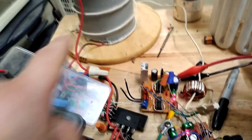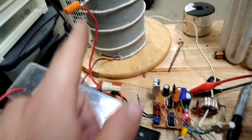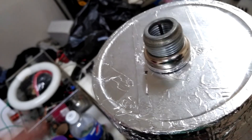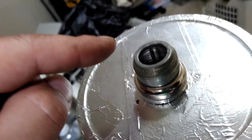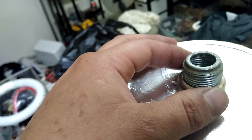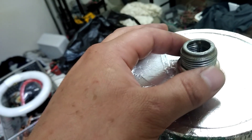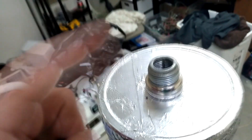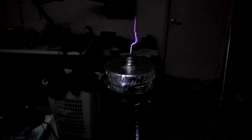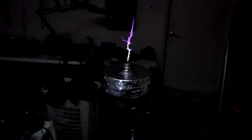I took a little shortcut here — I tried adjusting the primary without really changing it out to an optimal point, and rather than adding a bunch of top loading on here, I'm just trying to shape the arc so it goes more straight out. Playing with the low voltage setups I've been able to do that before — a lot of those already have sort of a vacuum tube-ish discharge. If I shape it like that I can get more of a straight-out arc and it's probably going to be a little longer, so we'll see how that goes.